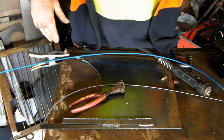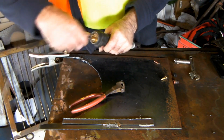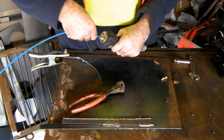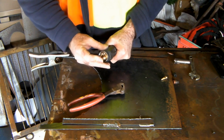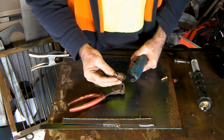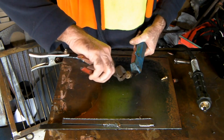Now with the new blue liner, just do exactly the same thing but backwards. Make sure you've got your torch stretched out nicely and then feed it in like this. You should find it goes in with no worries at all - if it gets a little bit tight, just wiggle the other end of the torch lead. You'll be amazed how much difference this makes. Push it home onto the fitting and put the screw back on again - this is really simple to do. If your liner is exactly the same length as your torch it'll fit flush; if it's longer, just snip off the excess with your snippers.